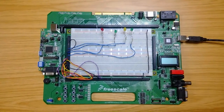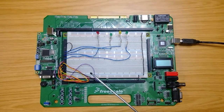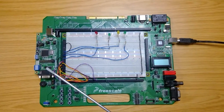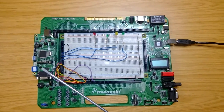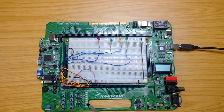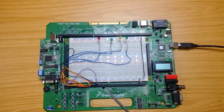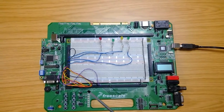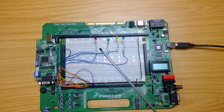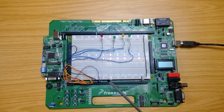These requirements are: a start function switch; washing machine on and off indicated by red LEDs; washing cycle on and off indicated by green LEDs; temperature set using a potentiometer and the current temperature set using another potentiometer. Temperature within range will be indicated by yellow LEDs; a temperature indicator using 8 LEDs located on the board; and a load warning indication shown by blinking LEDs. If the load is greater than 5 kg, a safety action kicks in and we stop the washing cycle.